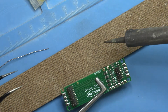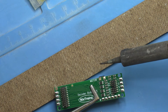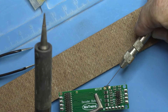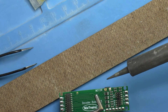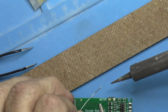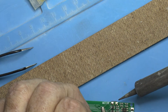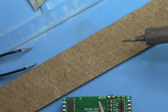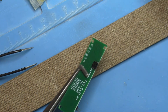Just a quick pop of heat's going to do it. Now, just to show you that the two motor leads can go on top — they'll just get tacked on top, it's not a big deal. Just the way we usually do that: add a little bit of flux, and we're going to just touch that solder to the pad, tin it up again, and it'll leave the TVS on the bottom solid so that it's not a problem. You can see now, if you went in there for about that same amount of time, you could tack the motor wires onto their proper pads. And the TVS just crosses the pads on the bottom — that's all there is to it.